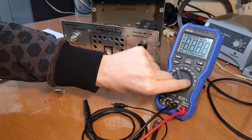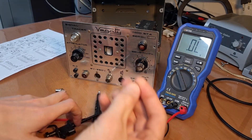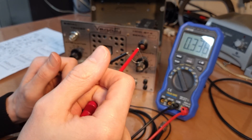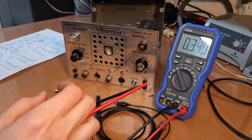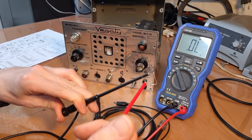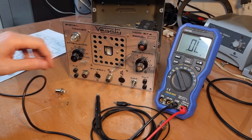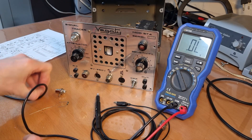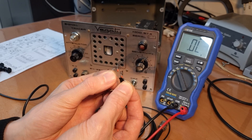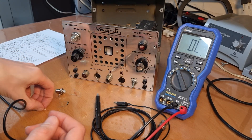Just to quickly show you that it's actually a germanium diode, let's go into diode test. Banded side to the black lead, the other side to the red lead, and we get a voltage drop of 0.3 volts, which is about half that of a normal diode. If we turn it the other way around we should get nothing — and indeed we get nothing, so this diode is fine. For the capacitors I need 470 pF. I don't have that in stock but I do have two one-nanofarad capacitors, quite small, so I'm going to use them in series — that should give us about half a nanofarad. And then we just need a 470k resistor.